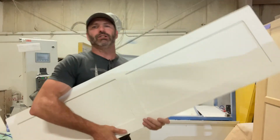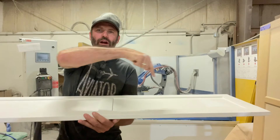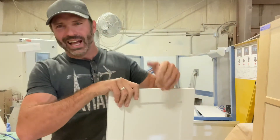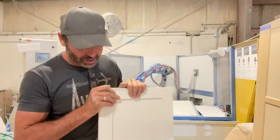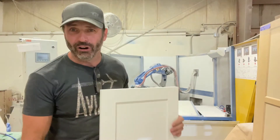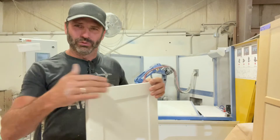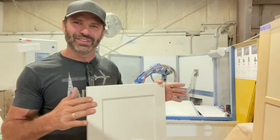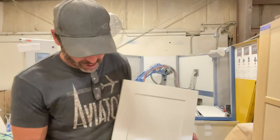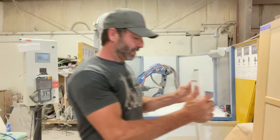Last but not least: doors that look like this — anything that's double panel. We're not coming all the way across with the laser and picking up any mid rails. That part is on the drawing board and it is equipped to do it, we just haven't written the program yet. There's a good chance our 2023 model will have it, and we'll just send the upgrade out to everybody, no problem. But currently, as it stands, we're not picking up any mid rails. Generally speaking, with the sanding envelope of 24 by 48 inches, you're not going to get a lot of split panels inside that sanding envelope anyway — even this door is probably too big. So anything with a split panel, unfortunately, is a no-go for Cosmo.